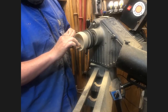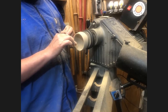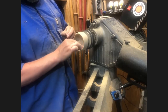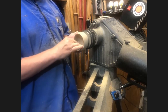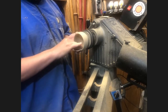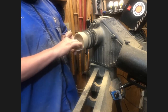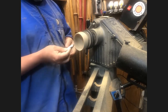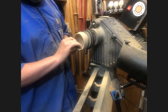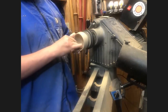Didn't somebody say that last week in the meeting? Yeah. We're always liking the brown bag to 800 grit. Yeah, that's what I've heard most people say, but Russ would always say 1,000 grit, and that's where he would finish. Well, he finished sanding at that point, but then he used a horsehair brush, it looked like a shoe brush. Yeah, and that thing would shine like it had lacquer on it.